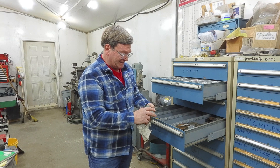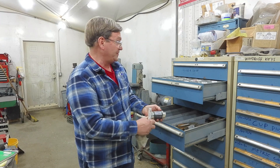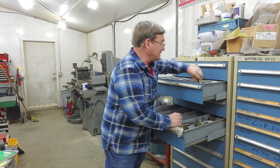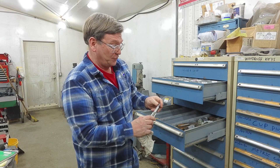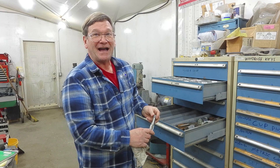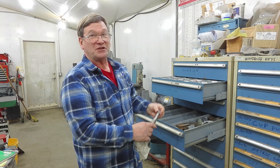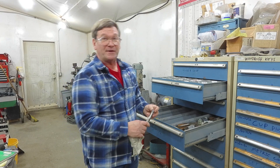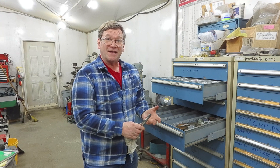This one here is a special oversized tap, and it's labeled by pitch diameter. We keep it in a different place from our regular taps. What you normally see for the most common ones will be a GH — GH4s, GH3s. The G just says it's ground and the H is an H limit — it's for how much variance you can have in the size of the tap. For larger taps you use different numbers than for smaller ones, so it's best to look that up. A real common reason to choose a different size is you just want something to be loose, so you'd want a larger tap.